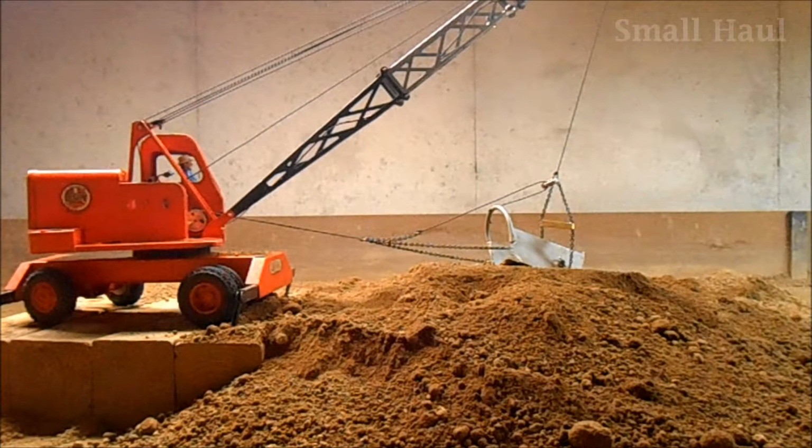Well, Frank, I got your dragline just about finished. I just actually started running it. I'll probably run it maybe 10 or 15 minutes. I changed the dump rope, it was too short, and messed with the chains a little bit, but I'm really just going to run it for a while and see how the bucket works. But it sure loads nice. It sure loads itself up nice.